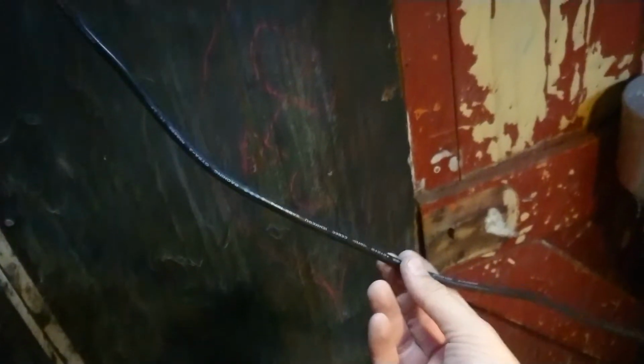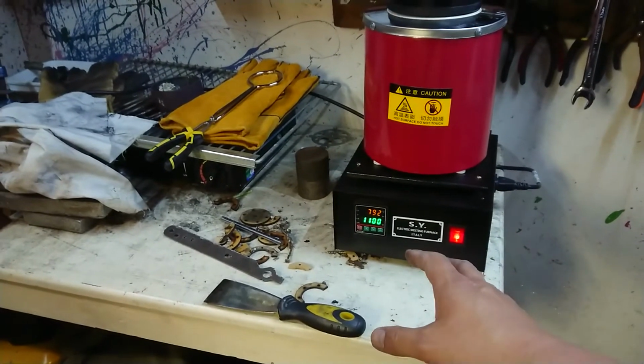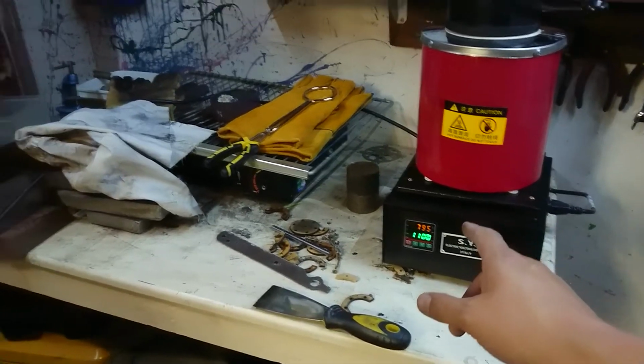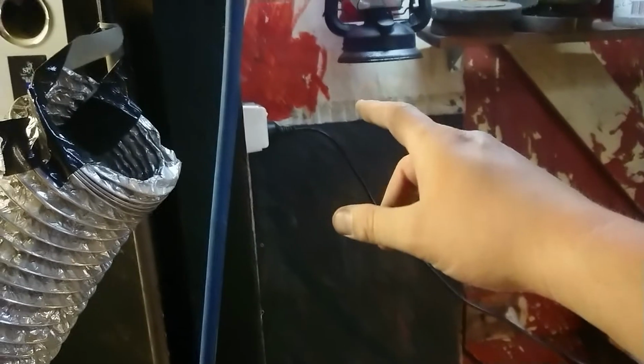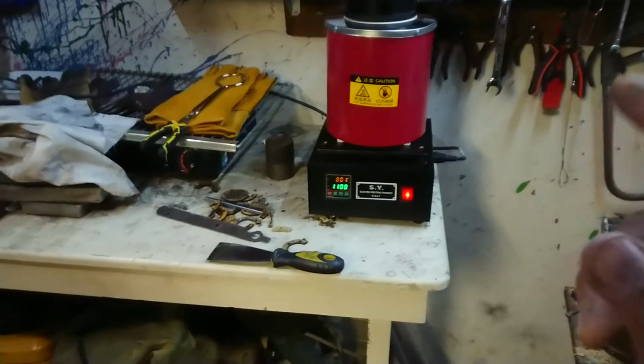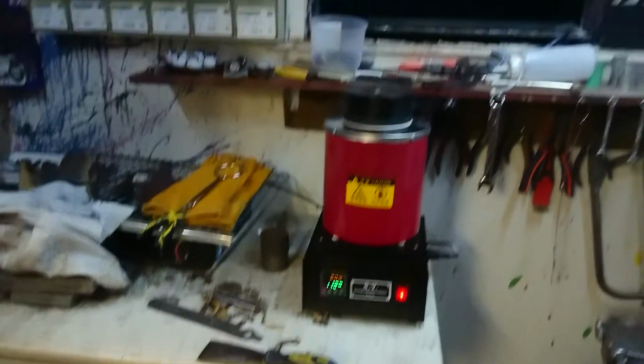Okay, so one noteworthy thing I've just noticed, this cable is noticeably warm. It's about 30 degrees. And that's just a cable I had floating around, so it's probably not quite rated for it. I'd say this unit is pulling a full 2400 watts, especially given how quickly that temperature is rising. So yeah, I'm just rethinking how I'm going to draw some air out. I think I'm going to grab a battery fan, because I think I'm probably pulling almost as much as that power point will give out. So yeah, I'll have to probably get a heftier lead at some point. I'm going to go get a battery fan.